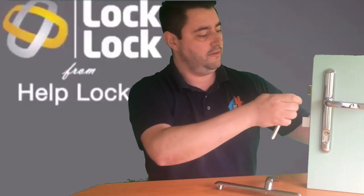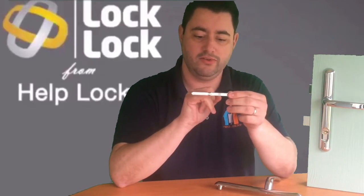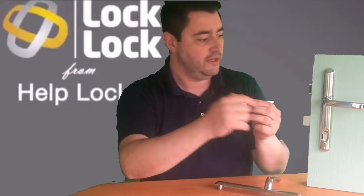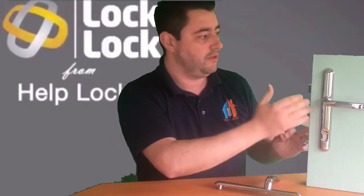Because this works by gripping the spindle, if somebody goes absolutely crazy trying to pull the handle down while it's locked, this little groove just in front of the knuckle is actually a sacrificial part. This spindle is designed to break if it's under that kind of attack — it will deliberately break so the handle just spins round and round without controlling the door. Because the locking mechanism is on the inside, even if somebody managed to strip everything completely, the door would remain locked.